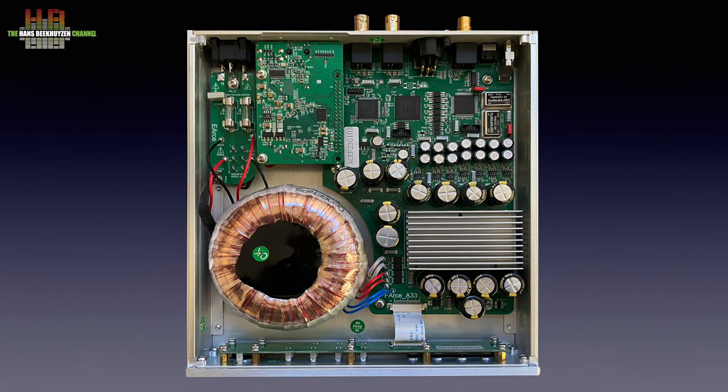The chassis is easily opened by removing four Torx screws along the top of the back panel. When opened, we see a small circuit board holding the IEC mains inlet, two fuses, and mounted on the back of the board the voltage selector. This can be accessed from a hole in the bottom of the Arce. Although distributor Vinshine will send you a device set to the correct voltage in your country, it doesn't hurt to check prior to first use.